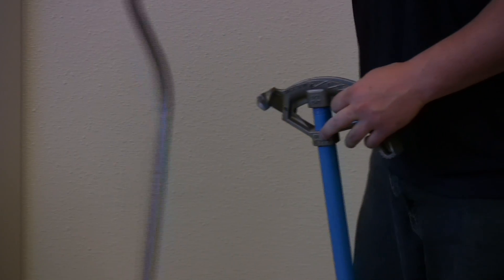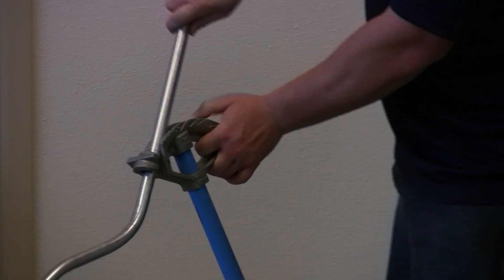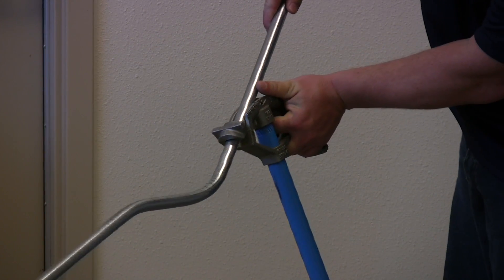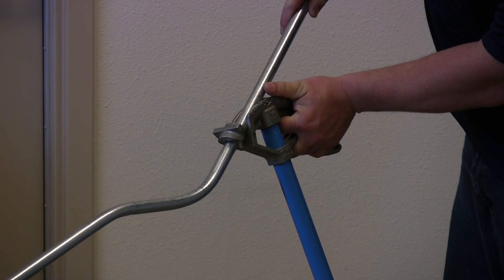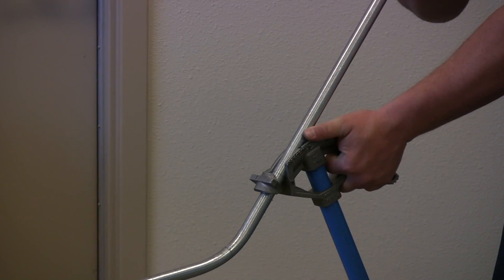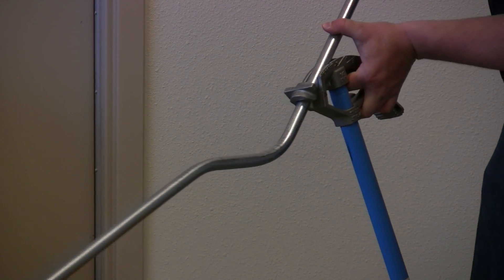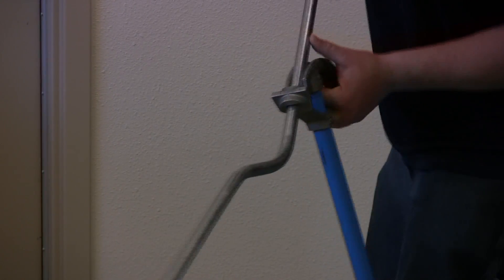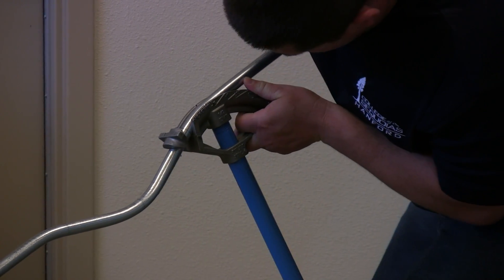Go ahead, lift it up. Pull the conduit out and flip it around. Reline it up with the C mark on the arrow. Line this up so you don't end up with a dog leg. Make your little vise — toe in front, knee in back. We'll take it to 22 degrees.